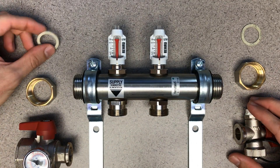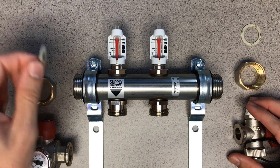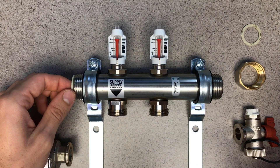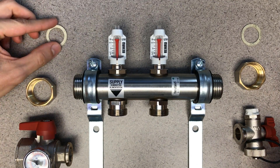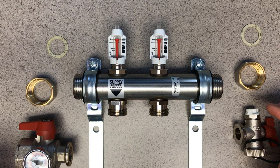What we want to do first — and this is an important part of the procedure — is to wet this gasket briefly. If you're starting with an air test and you use a dry gasket, it may leak right there. As soon as you fill the system with water it works fine and it will seal, but if you're going to do an air test before adding water, just get that gasket wet briefly and that's going to help it seal up even with no water in the system.